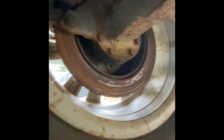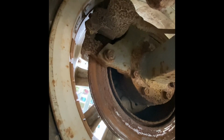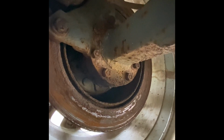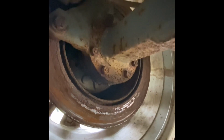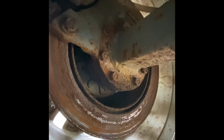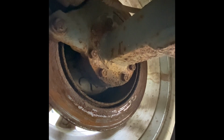These are 100 series rear discs, 75 series rear calipers, 79 series rear disc calipers, and that's a front spindle out of a 100 series front live axle, which I've accommodated. I put some photos up of how I did that. And then I used high tensile grade bolts, which bolt the spindle in exactly how Toyota did their front diff.